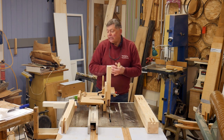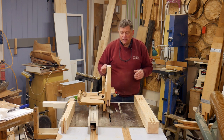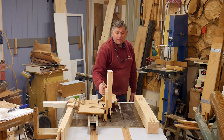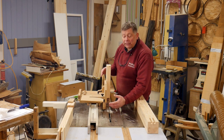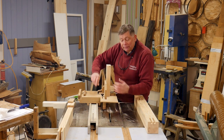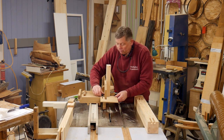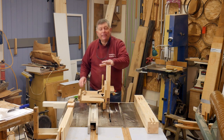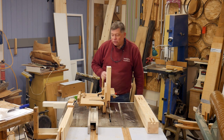The last thing is it is guarded. The guarding is pretty good, actually, and most tenon jigs have zero guarding. There are three guards in this system. I've got a guard at the back here so that when this is furthest forward, my hand can't accidentally make contact with the blade. When it's right back here and I'm changing the workpiece, I can't accidentally scuff my knuckles because there's a guard there. And I can't get my hands in at the side because I'm using a standalone guard, which I'll show you in a minute. So if you've got another jig which does those four things well and is better in some respect, please tell me because I want to know about it. But until then, this is the ultimate table saw tenon jig.